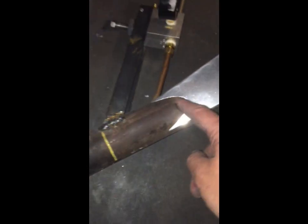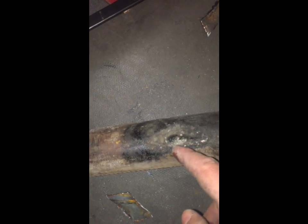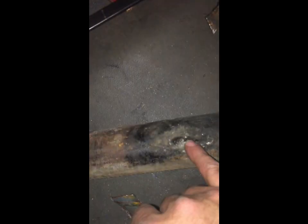Okay, so it's going to go through this pipe, and then on the side of this, there is a bleed air system. As the air flows through this pipe, it's going to be restricted right in this area, which will drop the pressure, but it'll speed up the air going around it, which will pull air through this hole right there. And that hole gets its bleed air from that pipe right there. And I'll show you that a little more in detail in a minute too.